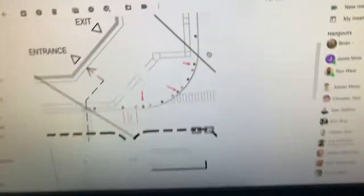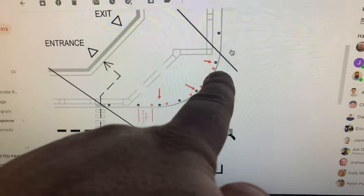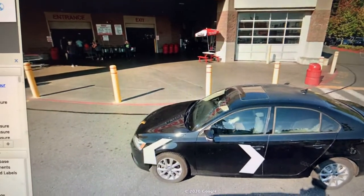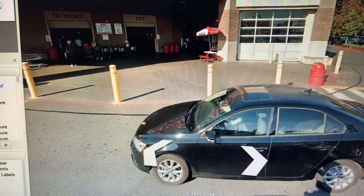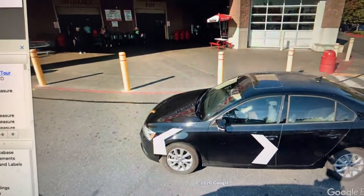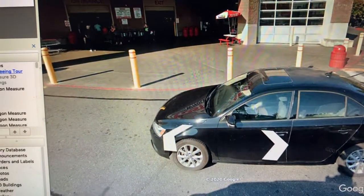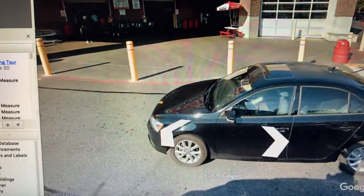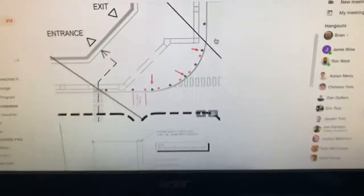For the new bollards, they want to add what you see in red — five bollards total. I'll have them marked out correctly on the concrete, and I'll probably do a final docket video to make sure they go in the right place. We need to install five 6-inch diameter pipe bollards, 4 feet in the ground and 4 feet above ground, with five core drills done on the concrete at the marked locations.